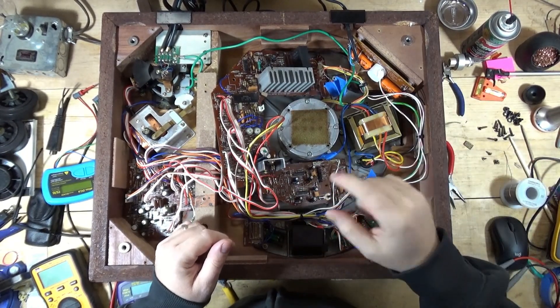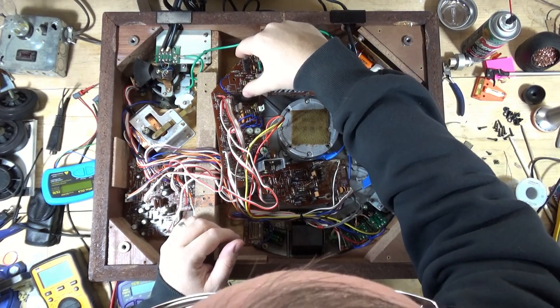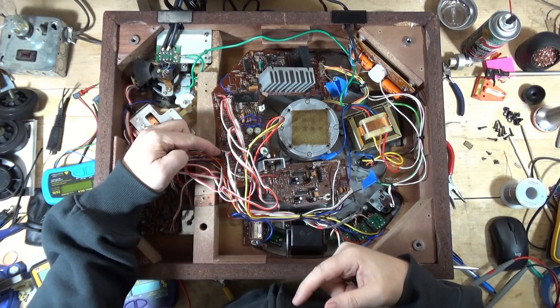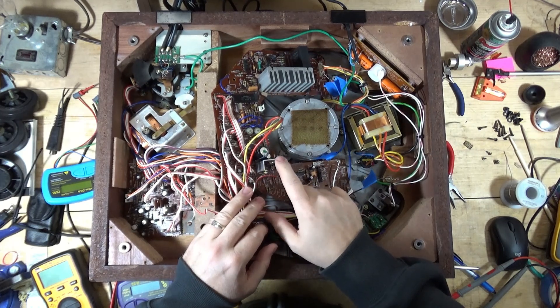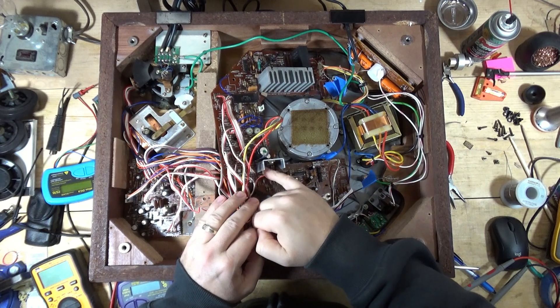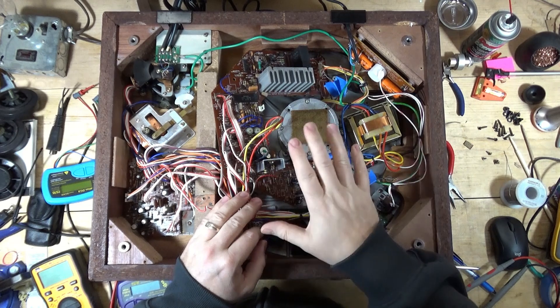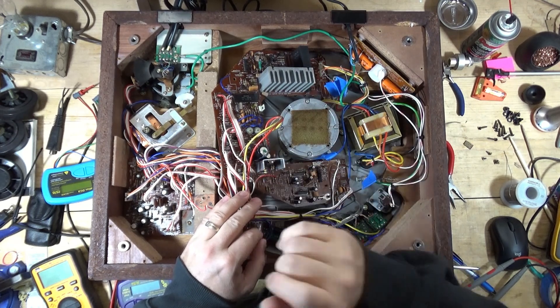The direction I think I'm going to go is — I did this section yesterday and then this little segment. I'm going to do this little segment and then this segment. I tested the voltage regulator and I'm getting good voltage on either side: 13 and 5 according to the schematic. That's what I should get, so right now I'm comfortable with the regulator.